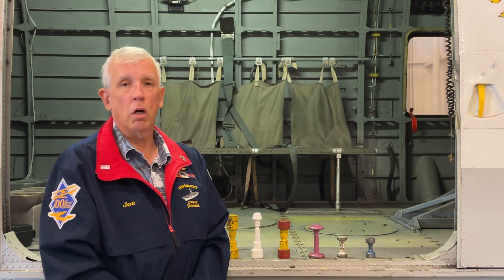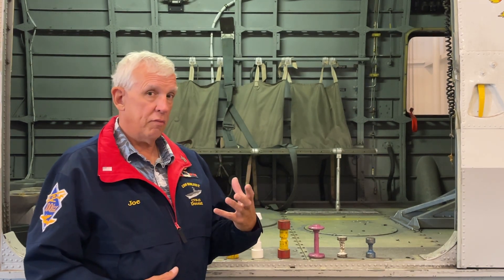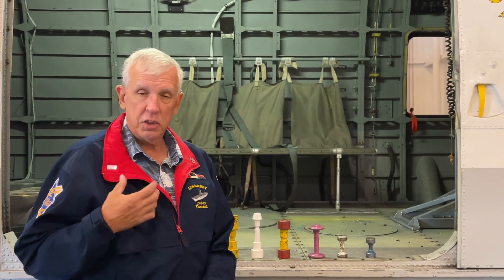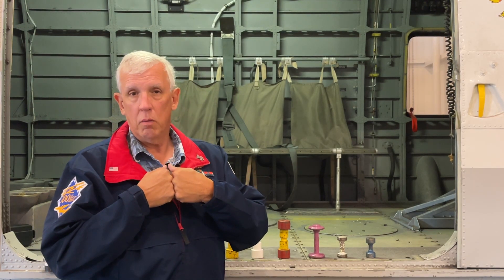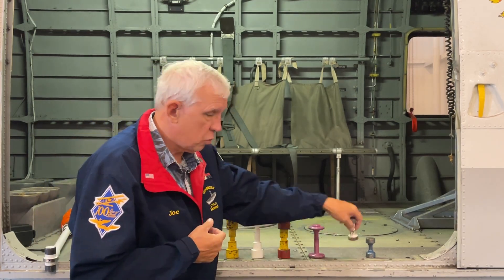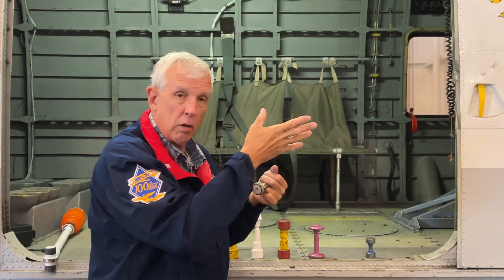We're going to go into more detail on the actual torsion bar. Briefly stated, on the aircraft there is a block called a holdback fitting, and on the carrier there's a block that attaches to the flight deck — also a holdback fitting. We place those two together when we get the aircraft up on the catapult, and we put one of these torsion bars in between those two. This is the weak link in the system, and when they stress the catapult to the weight of the aircraft and push the button, the catapult will start to pull the aircraft until this torsion bar breaks apart, releasing the aircraft. That's how the aircraft gets launched.